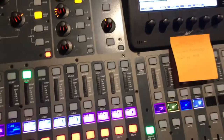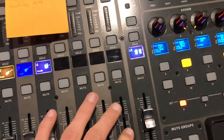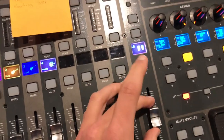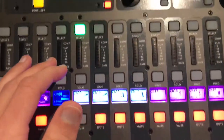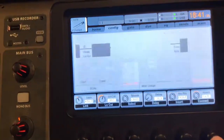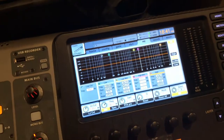So I'm back here at my soundboard, and we're going to be using channel nine — my microphone. I've got that unmuted. One thing to keep in mind before starting this process is to make sure your master fader is at zero, or wherever you run it on a Sunday. If you run it at five, make sure it's at five. I'm going to put mine at zero, and also make sure the channel fader is where it's normally at. Now you're going to want to get into an EQ — this is the EQ built in on the channel strip for my microphone.